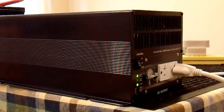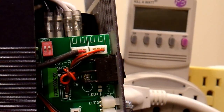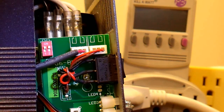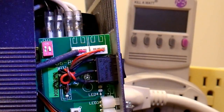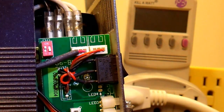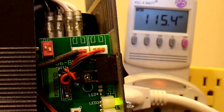First we take out this end panel. But before you remove the end panel, obviously you'll want to turn it off because there is live voltage inside. With the end panel popped off, you can see the switches here that I was referring to. Right now they're both up — both in the on position — and that apparently is 120 volts. What you can do is, with the inverter off, try a different setting. There are only four possible combinations with two switches. I'll just flip switch number two down and turn the inverter on to check it. You can flip those switches with the inverter on — I wouldn't recommend it — but it does not actually change the voltage until you power cycle the inverter. So just do it with it off; it's safer and you have to do it that way anyway. And now you can see that the voltage changed to 115 volts, which is what I wanted.